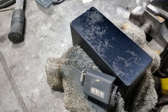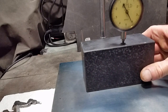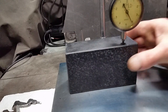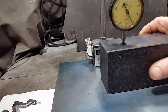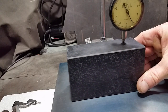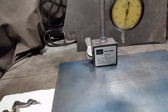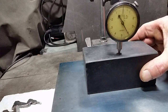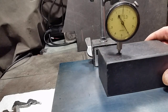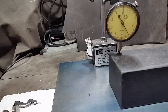And that's just about coming into fruition right there — that's where we finished it up. There's a little bit of movement there. I think it just dropped down, because now I don't have it there. So that's the biggest movement I have there — definitely less than a ten-thousandth. That proves this side against that side. There's a tiny bit of movement there, maybe a half a ten-thousandth. Not bad.